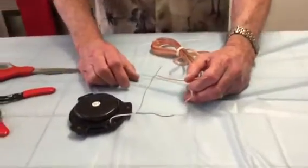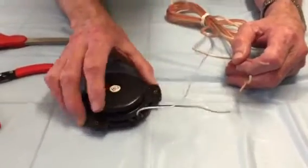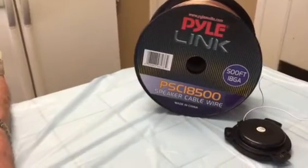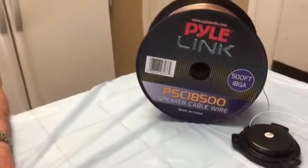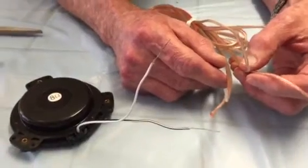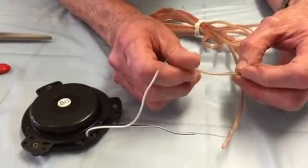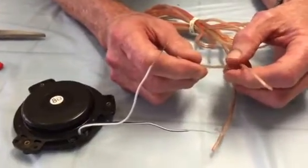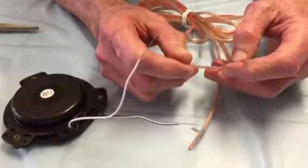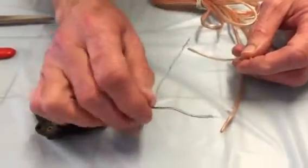This video is the really hard part. This is where we're going to connect the Dayton Puck to the PileLink 18 gauge speaker wire — 18 gauge is what you're looking for. This wire clearly shows the hot wire in red and the ground not in red. Each speaker wire has its own way for you to know which is the hot wire and the ground. The hot wire on the puck is the white.